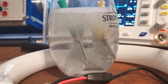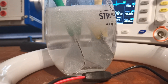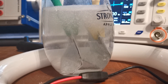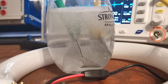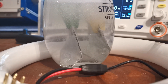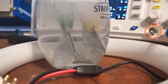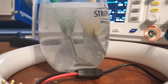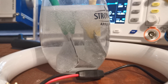I think there is kind of a sweet spot of input power and what you get out. Also maybe the setup itself - the electrodes could of course be optimized. This is just two sheets of aluminum foil each folded four times. The geometry may also play a role. I don't know, I have to do some research and experimenting. But maybe with high voltage we can improve the efficiency of generation of hydrogen and oxygen out of water.